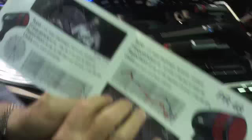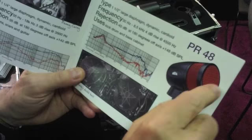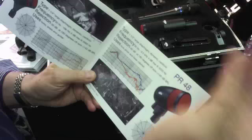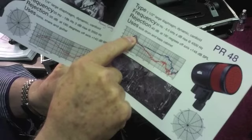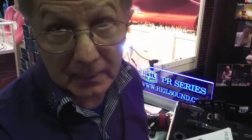The first thing we did was a kick drum microphone. Everybody builds one, but it's a cheap little two-dollar nothing element with no design to it. After looking at analytical equipment data over about two years on the road, we discovered that all bass drums average around 50 to 100 Hz. This is a big dynamic — it's an inch and a half, it's huge. All other dynamics you see are about half inch. We built a big one and we put a spike passively — a low-pass filter right in the middle of 50 to 100 Hz. It then goes out flat, and then we come back up between four and six kHz for the beater, and then rolled it all off at 8k.